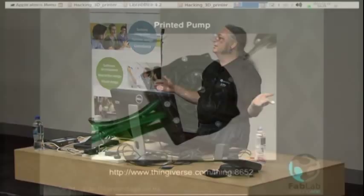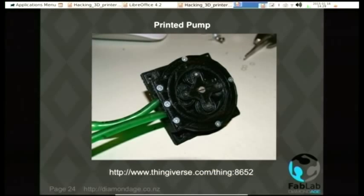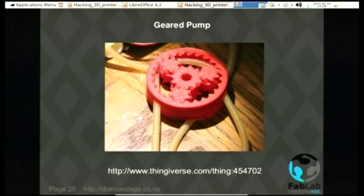If you want to push large amounts of liquids around your 3D printer, you want to use that sort of design. Of course, we're talking 3D printing, so you can 3D print one. The problem is that kind of design requires a lot of torque, so you can get stepper motors with gearboxes. But we can get really creative — we can actually put the peristaltic pump inside the gearbox, which can only be assembled by 3D printing because you can't slide the gears past one another.